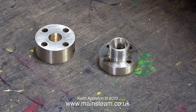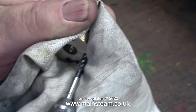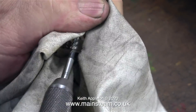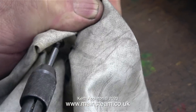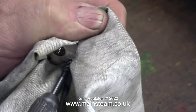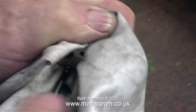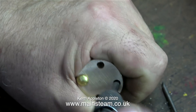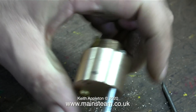Here are the two parts that I've made. The first one threads simultaneously into the boiler bush and into the copper pipe from the regulator itself. The first job in this episode is to thread the holes in the flange which screws into the boiler. I've made this flange a bit thicker — shown on the drawing as 3/16ths of an inch thick, but this one is 5/16ths.